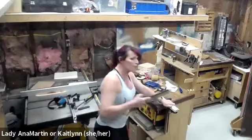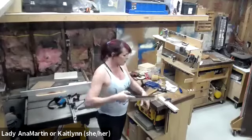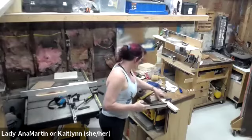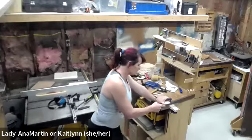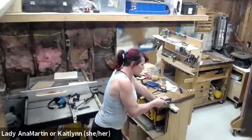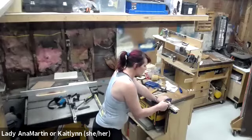When I go to cut, I'm going to lift on the toe. And if my toe's down, well, that's not going to stay, is it? No, whatever, we'll make it work. If I've got too much on the toe, it'll grab. If I've got it on the heel, then I can run through. It's okay to do a starting cut by pulling backwards.